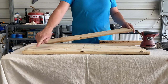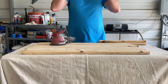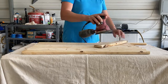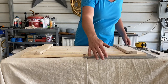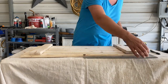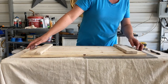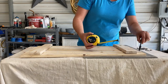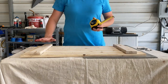This is some scrap wood I had on hand — as you can see, some of it is bowed. I'm also going to be using my orbital sander and my safety glasses. I begin by sanding the ends, the sides, and the edges of all the boards to give them a nice smooth finish. Once that's complete, I lay it down next to my square making sure all the back pieces are flush, then I measure how far I want my braces to go — I chose two inches off the bottom of the frame for both braces.